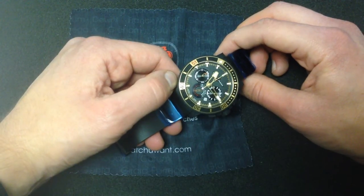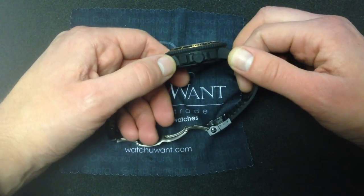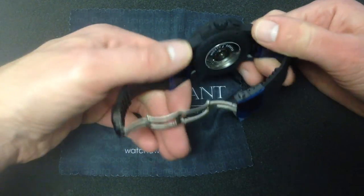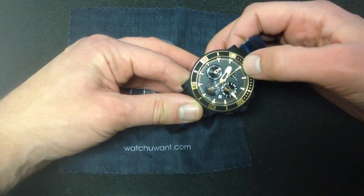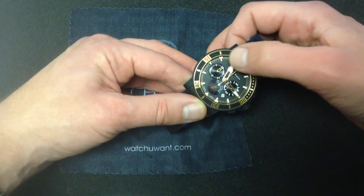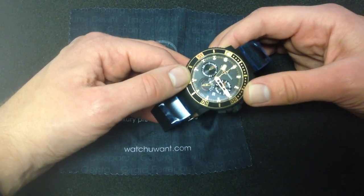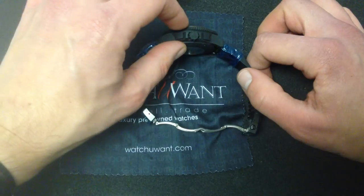The watch is very accurate — it's a 2892, and I can't tell you how many of those have been made in chronometer grade. Keeps perfect time, as good as any Rolex. Beyond that, Ulysse Nardin decorates it with its own special winding weight, and you have that sapphire case back to show off the works. It's a good-looking movement, and it works just as well. In terms of the dial detail, Johnson wanted highlights, not bling, and he got it, with rose gold elements being the primary reflective elements, with the exception of those sub-registers and their glossy chapter rings. It reads quite elegantly — for a 46mm sports chronograph, this is about as close as you can get to a dress-appropriate watch.